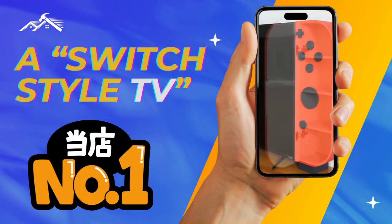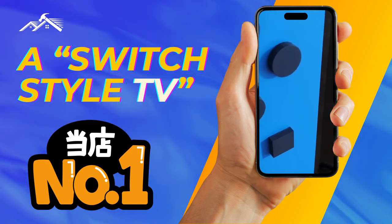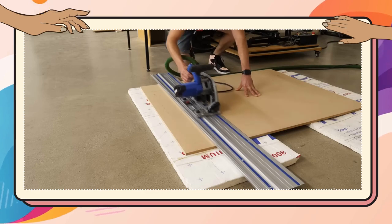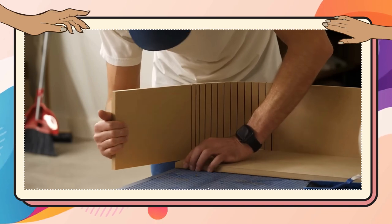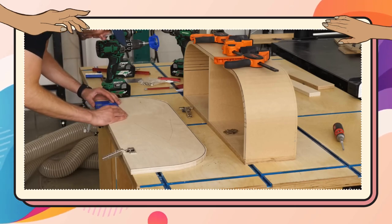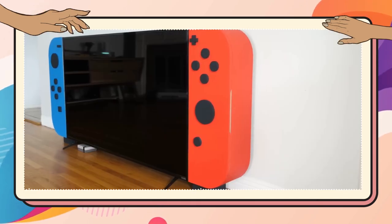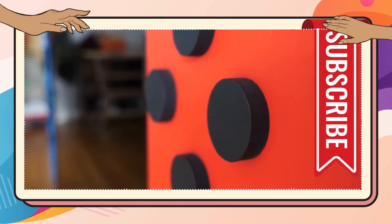Number 1: Give your TV a new switch-style unit for more storage and a fashionable look. Start with anchor back panels crafted from 1/2-inch MDF. Use curve cuts to wrap MDF around the back panel, then reinforce one side with sturdy 3/4-inch plywood for hinge placement. Incorporate a fixed shelf and two removable ones inside. Add doors and amp up the design, making it resemble a gaming controller. For stability, set this unit atop a base box matching your TV stand height and link the two using MDF strips. Decorate with handcrafted buttons, analog sticks, and a D-pad — a creative, fun, and functional project for gaming enthusiasts.